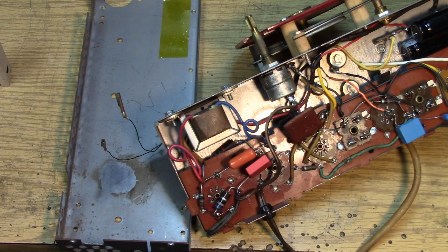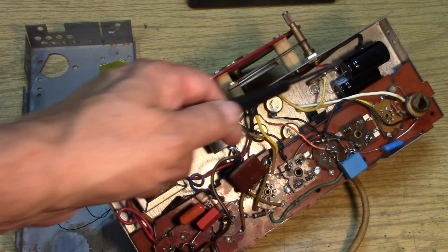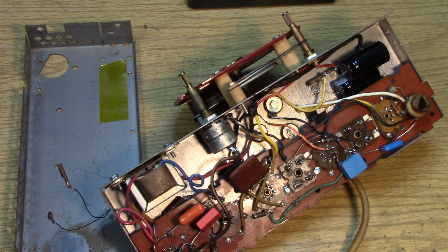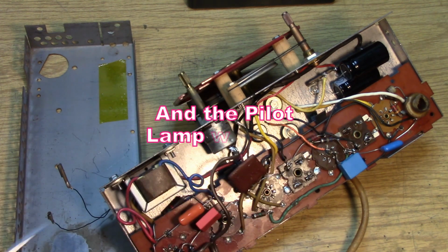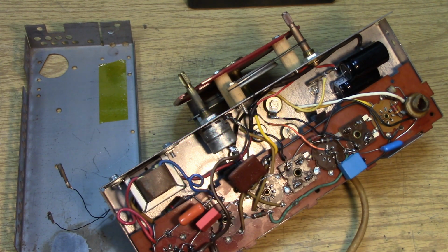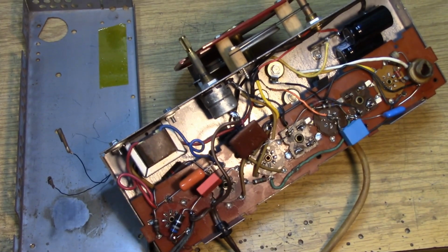So you can see that there's probably 3 problems with this radio that would have prevented it from working just by plugging it in. 3 separate problems so far. First of all, you have the power supply electrolytics that were likely bad. You had that input line capacitor, the Black Beauty, which was probably bad. And perhaps any one of those other caps could have been bad. So you had a lot against you just turning it on, hoping it would work. And notice I didn't mention tubes, because it turns out that the tubes were all good in this radio, and wouldn't have helped if you swapped tubes, that's for sure.